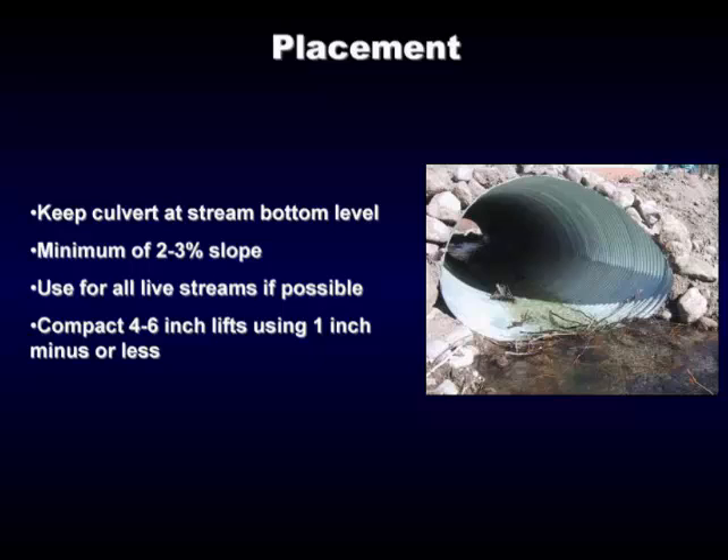This is a large 54-inch squash pipe that can carry a lot of water. It looks like a little tiny bit of water coming out now, but spring runoff pulls from a very large area. On compaction of these culverts: you have to get these haunches compacted really well and lay a nice compaction bed, or the water will seep right through it and wash your culvert out — it'll go right down along the side. Make sure your culverts get compacted if you're putting them in yourself.